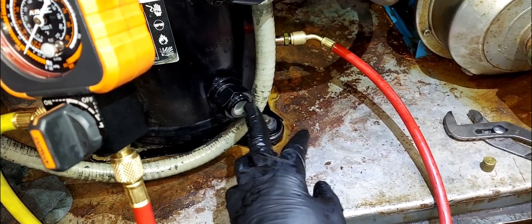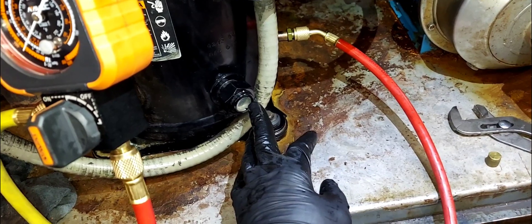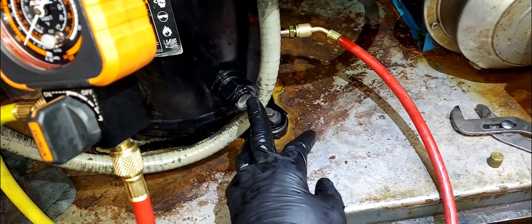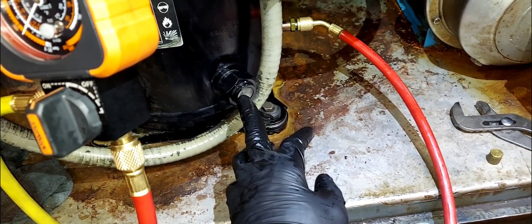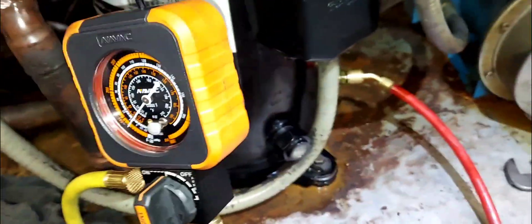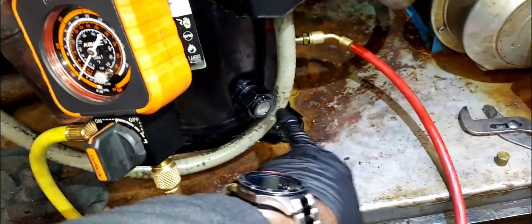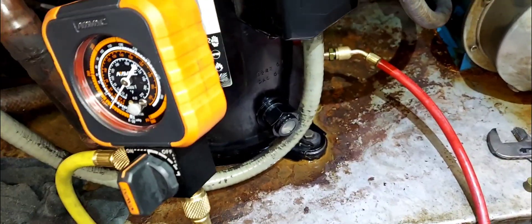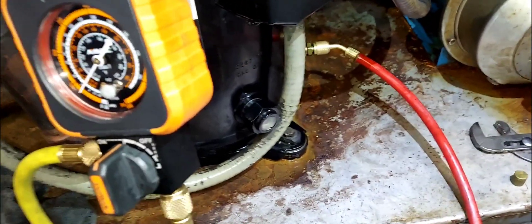It's going to be anywhere between 60 percent and 75 percent and you'll be good to go. I've never seen a compressor that requires less than that while it's off. While it's off you want to go halfway to three quarters of the way. You pump it in while you watch your level. You could do it while the compressor is running, but it's recommended to do it while it's off for a better baseline reading.